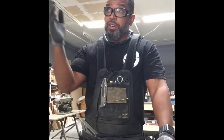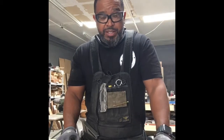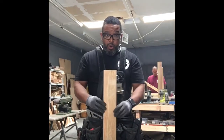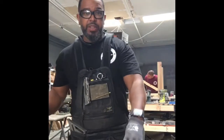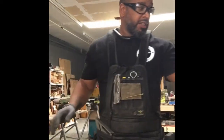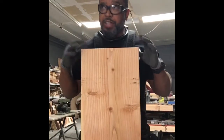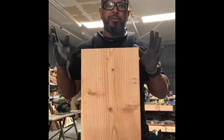So now you've cut your 2x12 to 5 feet, which is gonna leave you a 3-foot piece — two 3-foot pieces — which are gonna be the legs to the bench. You've cut your 2x4 to 4 feet, or a foot less than whatever size bench you're gonna make. I'm gonna show you why here in a second.